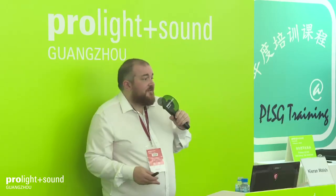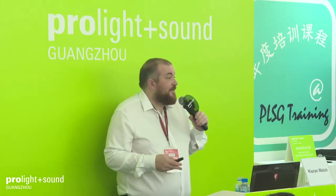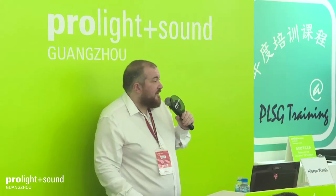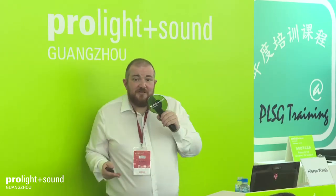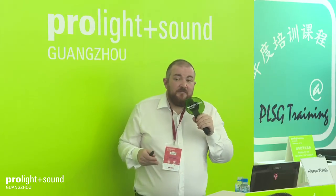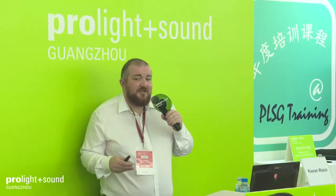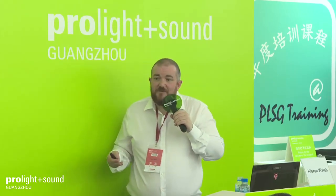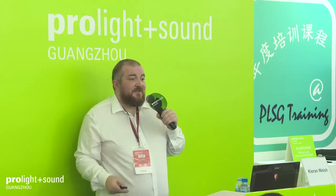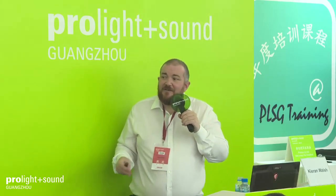The reason why we use a relative system is that audio over IP only really cares about a few aspects when it comes to quality of service. We care about delay variation. We don't want to have a highly jittered clock. But we only care about this delay variation when it comes to our synchronization signals, which are our PTP signals. Now, thankfully, there's only a small number of those every second. It's somewhere between 4 and 10 per second, so it's very, very low rate traffic.